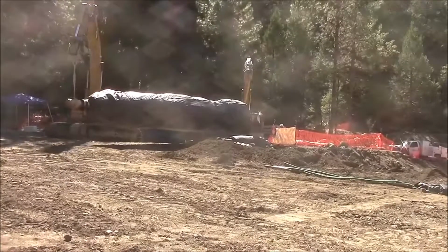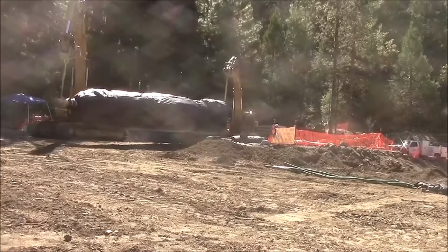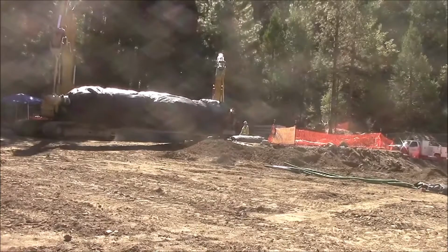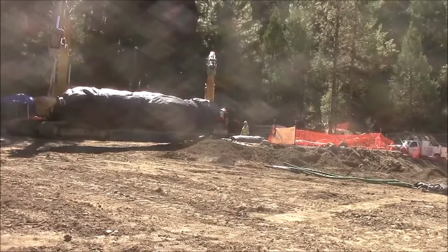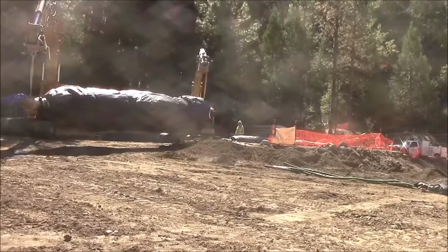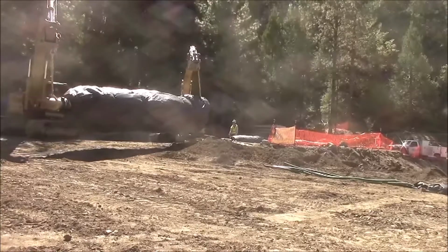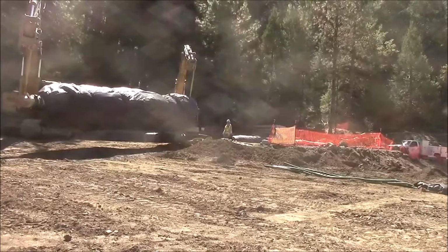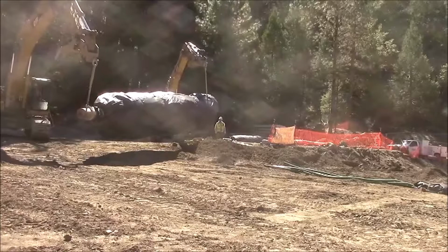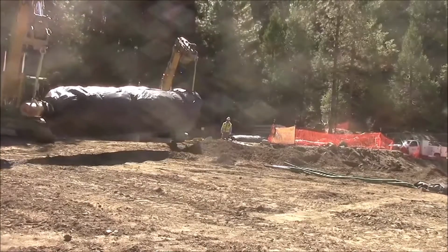Two excavators are moving the 16-foot tall, 255-foot long special closed-ended AquaDam. The starting end has the fill tubes coming up through the top, and the ending end has open-ended fill tubes, just like the start of a normal dam. So we will start with a double closed-ended end up on the wooden weir, and just begin filling the AquaDam, unrolling it upstream around the work area.